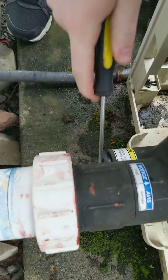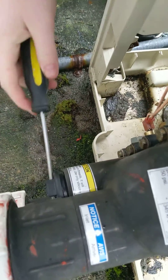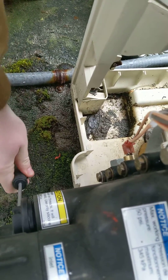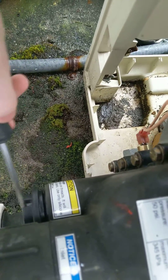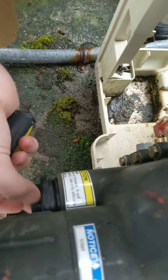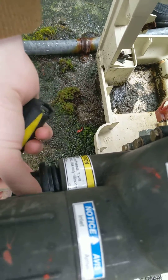It's pretty easy to replace, but you want to be careful as you're unscrewing the plug when the thermal regulator is inside, because the spring will push the plug out. It's plastic, and you don't want to strip the threads. When you get toward the end, you can feel that rubber gasket — push pressure toward the heater to keep the spring from shooting the plug out.